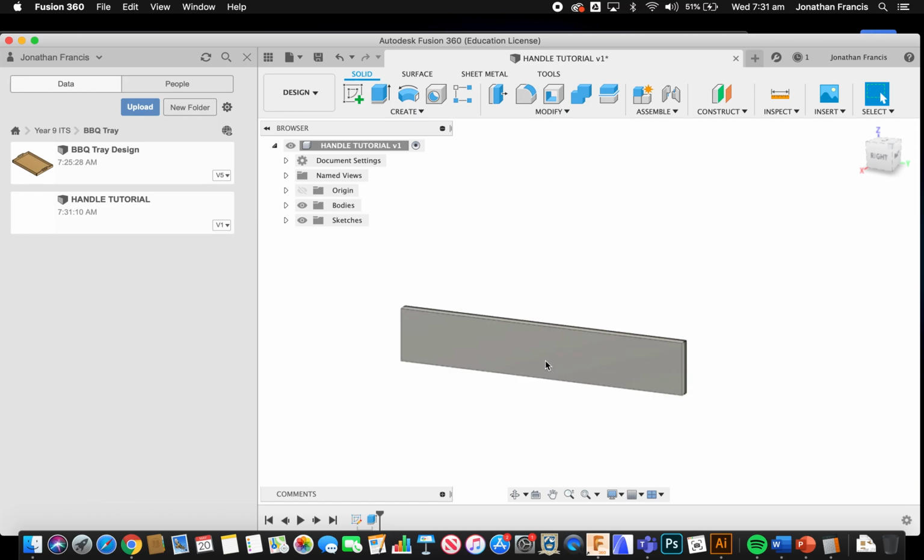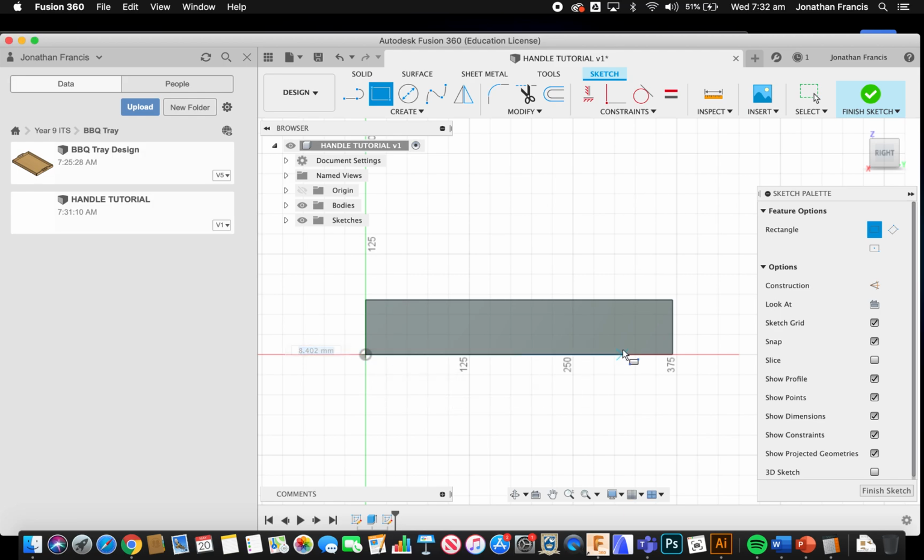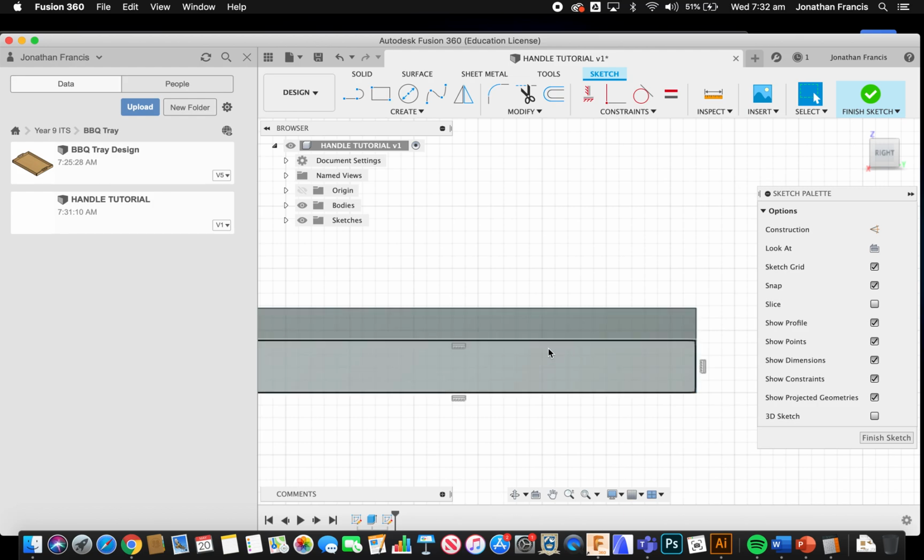Now on here, we want to draw our handle shape. Remember, this is up to you. The only real requirement is that where our handle side meets our side piece and projects back, we'll meet at a point that's 42 millimeters high. So you may want to put an indicator on here for that, and even if you just throw a rectangle in very quickly, we can go height of 42, length of 370. Means really you've got this top area here to play with when it comes to your design.